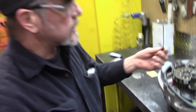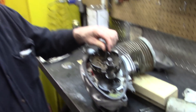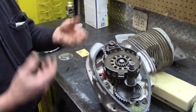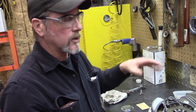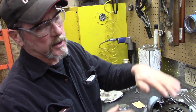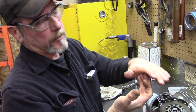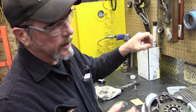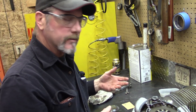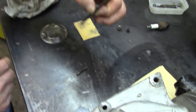Before you put the clutch in, you can't forget this piece right here. It comes across from the other side — most of them are like that as you're putting the clutch in. Then there's a cam that takes the spring pressure and pushes that back, releases the clutch, and then you can get neutral. Through that shaft are actually a couple more pins but they go in from the other side.